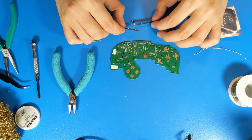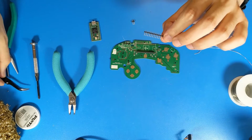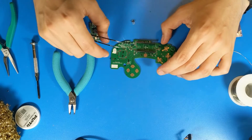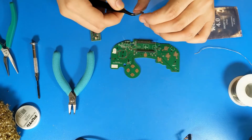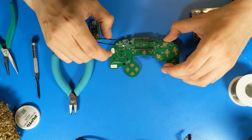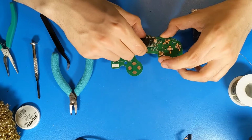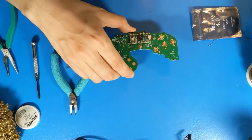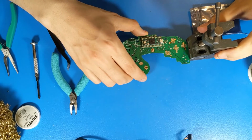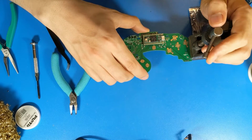You need two rows of 14-pin low-profile headers. In this case, the low-profile part is the thickness of the insulation. Unfortunately, they're kind of expensive, but you can get away with spacing the Teensy away and soldering in pins that are longer otherwise. But in this one, I will be using the recommended board, the recommended pins, so I won't need any modification.